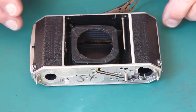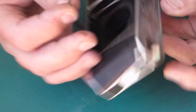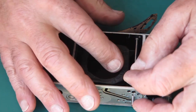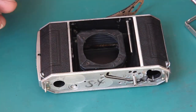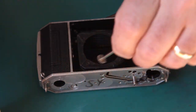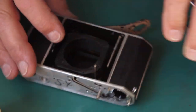It's time to start putting some components back into the body. I'll start by rubbing a bit of molybdenum paste on the shutter release, put the spring back in place, and then take the transfer shaft — the shaft that takes the action from the cocking rack at the back of the camera through to the front — and pop that into position.